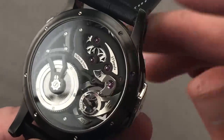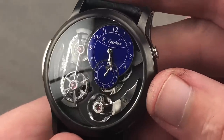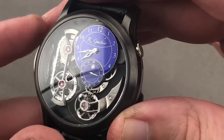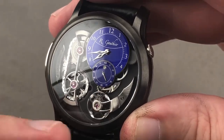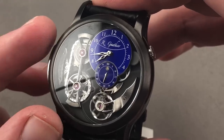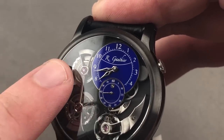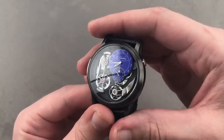The bevels are a mile wide, mirrored, and optically perfect. You can see the circle-within-a-circle design of Romain Gauthier wheels. Turn it back to the dial side and you can see a watch of extraordinarily rare beauty and innovation. Romain Gauthier is an engineer and a businessman — a representative of the finest traditions of the Vallée de Joux, because he sets the standard and accepts nothing less than perfection. He innovates his own fusée system, his own free-sprung balance, making all mechanical parts for his own use. Just look at the bridge for the fusée system — eight interior angles, the entire bridge between the two pivot points continuously rounded and black-polished. Along with the Grand Feu enamel and the titanium case: five pieces made. This is as good as it gets.